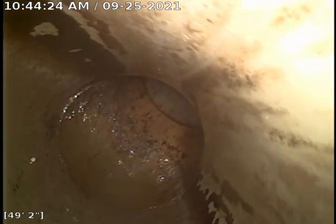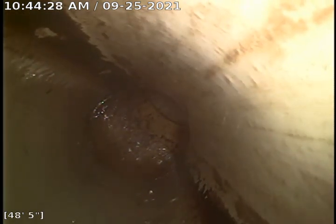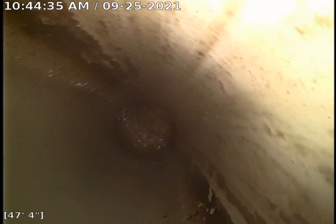This line is in excellent condition. A little turn right there — actually looks like another drop-down. You can see the camera is on the top left-hand corner of the screen, so that's actually a drop-down, a step-down in the drain line.